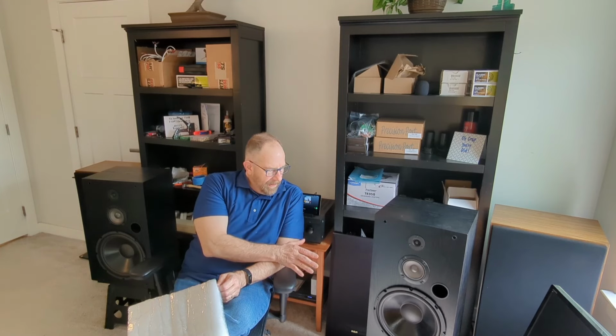So one thing that I always like to do is start audio tuning with the bass end. I like to get the bass done first. I think that once you lock down the bass, the rest is just that much easier, rather than trying to focus on a mid-range or a tweeter or a full range sound or whatever it is you're going after. I'd say start with the bass. That's your foundation. That's where a good majority of music is held, down in those lower regions, say 1,000 hertz and below. There's a ton of musical content there.